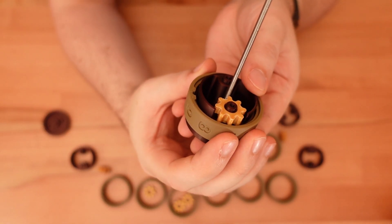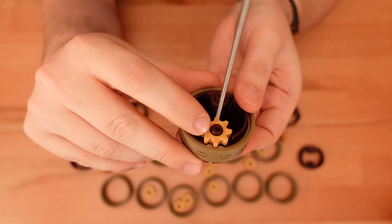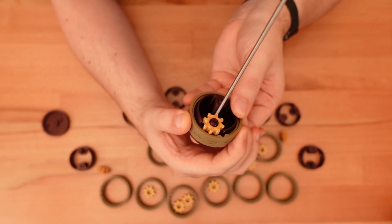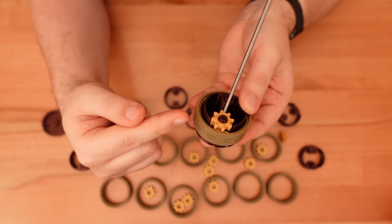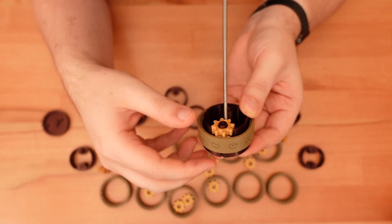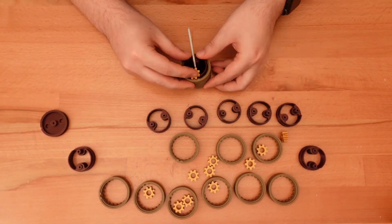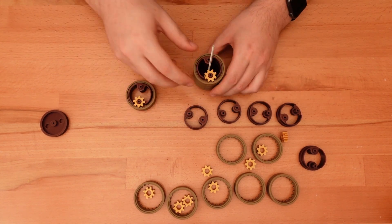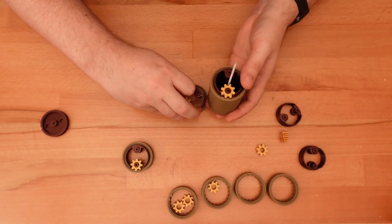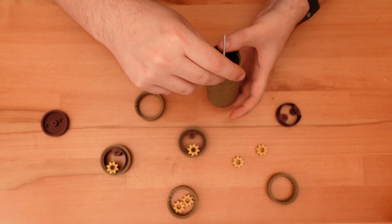Before going on to the next layer, I'm going to move this ring so that it's engaged with the indexing gear like so — the gear is right between nine and zero. As I build up the layers, I want to be able to test advancing the gear forward one and back one. So if everything's working right, it will go from zero zero zero zero zero to nine nine nine nine nine without any significant problems. Now I'm just going to take the next ring and continue this process all the way up the counter. Because I intend to turn this into several smaller counters later, I'm only using a single threaded rod. Regardless of whether you use glue, one threaded rod, or three threaded rods, don't force the layers together too tightly — that can bind up the mechanism.